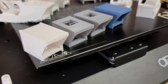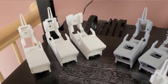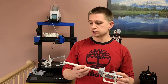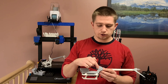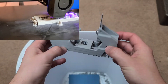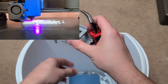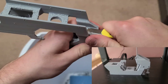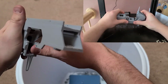There have been a lot of prints I've gone through to make this happen — I'll share some of the techniques I've used to get to this point. I've printed probably five to ten-plus frames. Now you will only need the landing screws on the bottom, the screws to tighten the bearing block against the tail boom, and just one set screw. I've been using organic supports to print this; it takes a bit of time to remove the supports without damaging anything, and it is a decently tight fit for the frame from the bearing blocks to the servos.